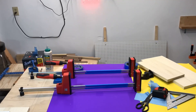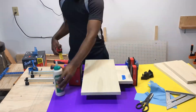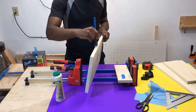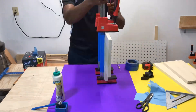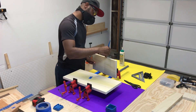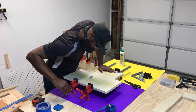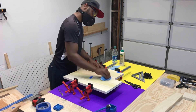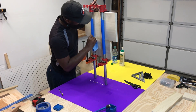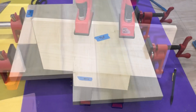Now we're going to glue up. I'm putting tape on the parallel clamp so I don't get glue all over it — that's a pain to clean. We're measuring using every piece we have because I don't want to make a second trip. I'm putting on wood glue and then adding clamps. I don't have any dowels because this is perfectly strong without them — the panels aren't that big and the wood glue is strong enough. Here we're using pipe clamps because I don't have that many parallel clamps. I'm removing as much excess glue as I can now with water so I don't have to sand it down later — it's a lot easier to do it now. Here's a visual of all the panels and clamps once they're glued up.